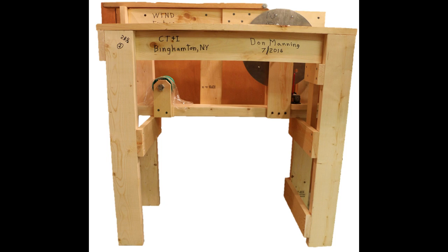This spool, we had our choice. The original production band chains were produced with 3/1000th diameter wire. Because 3/1000th was hard to find, we were able to find 4/1000th diameter wire. This is high tension wire called music wire. And the lower one is actually a spool of that 4/1000th diameter wire.